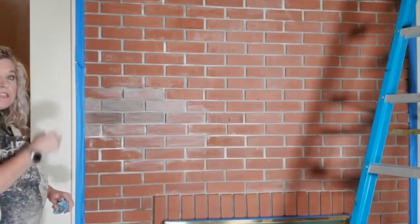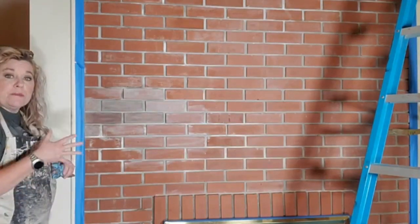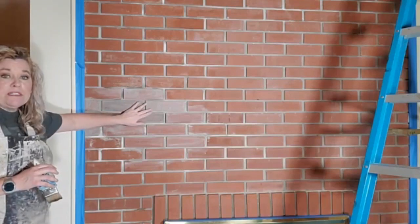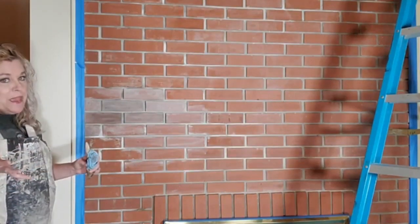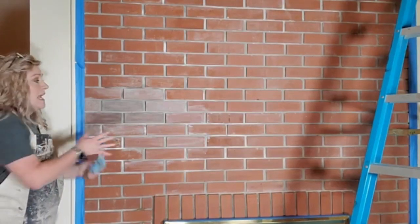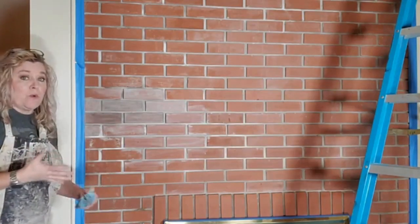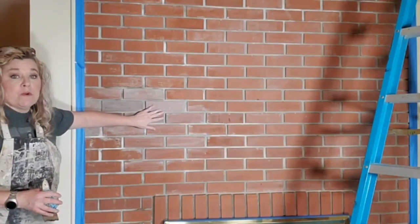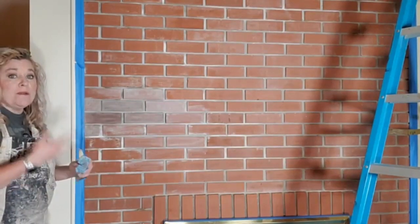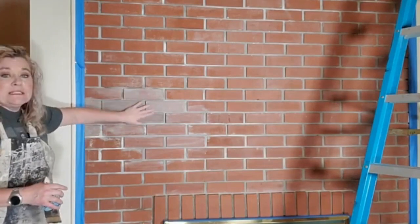I'm only doing this little spot right now because the top of this fireplace is about two stories up. You can start at eight o'clock at night but you may be up till 2 a.m. — it can be a weekend project and it's very easy. In most cases I do not top coat my bricks, especially vertical ones, because Dixie Belle doesn't require a top coat and the bricks look so much more natural without one. If you are going to top coat — usually for a horizontal hearth — use a flat top coat for a more natural feel.